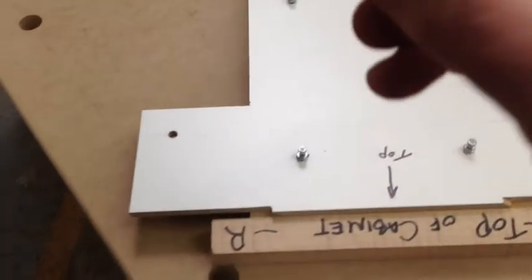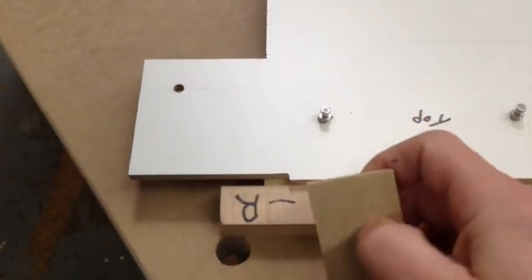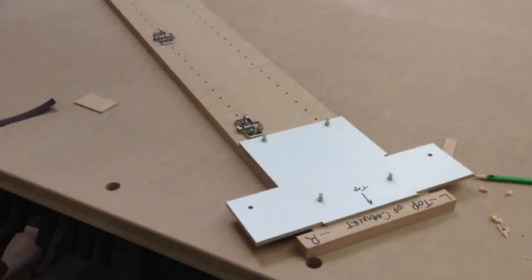And then these are the 1/8 inch spacers that we use. I made a notch here. Now there are times where the drawer front needs to be flush to the top, so we just remove the spacer. So hopefully someone gets some ideas from it.